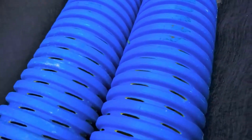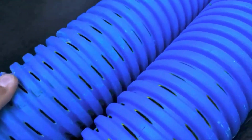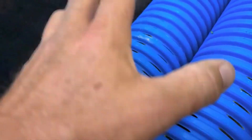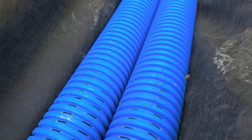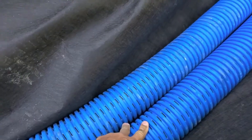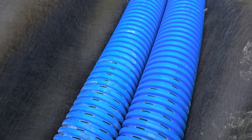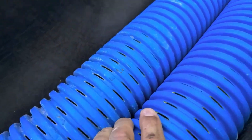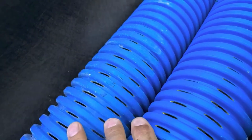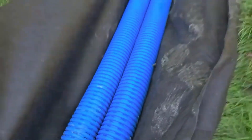We wanted these big outlets for two reasons. One, the water goes right into this pipe, and this pipe acts as a giant void — just like when we go up in size on aggregate, the larger the aggregate, the bigger the voids. If you don't have big aggregate available, it's even more important to put two pipes in, because you create the voids. Two four-inch pipes create a monster void in your system.